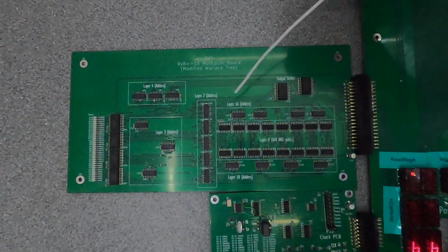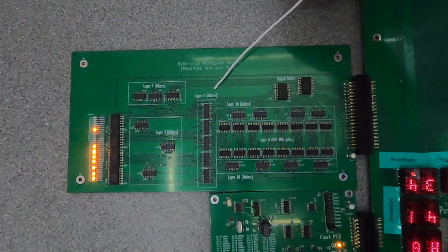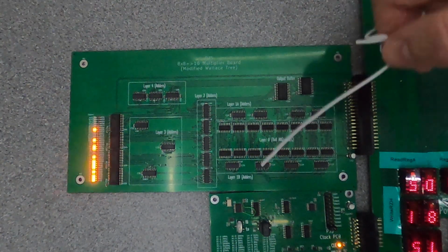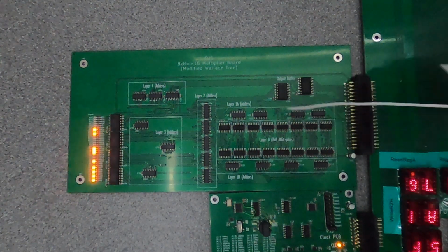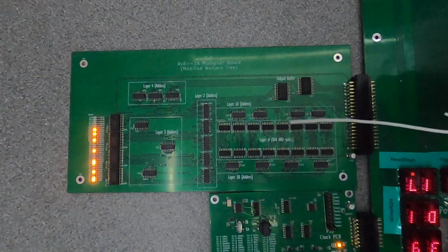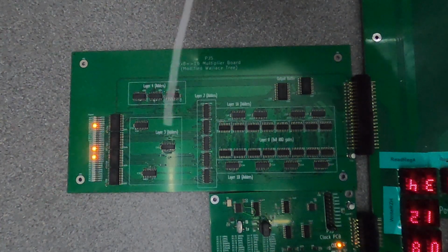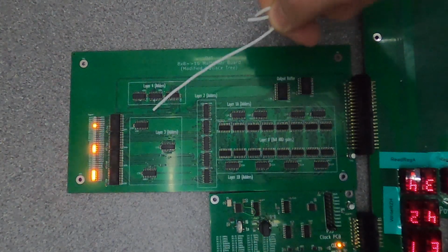The outputs of these adders, some of the signals that perhaps didn't get added the first time, go on to the next level. This is layer 2. And the adders there add up some more bits that have come in from the level 1 adders. I ought to clarify, these are level 1A and 1B, it's actually the same sort of layer of adders. These take inputs directly from the AND gates. But just for board layout, they ended up getting split to keep the traces short. So anyway, layer 2 adds those bits up, and then they come over to here. We have layer 3, which again adds them up.